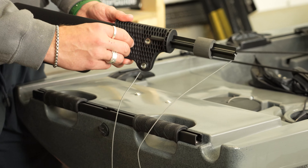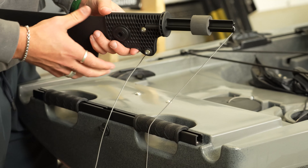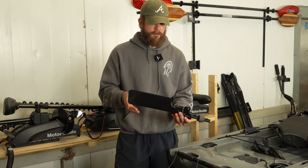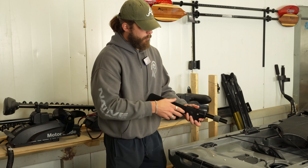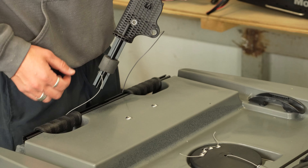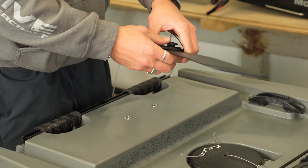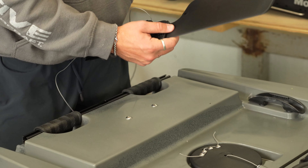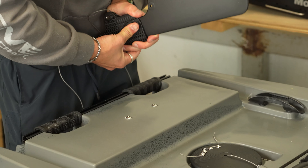Before I seat the teeth, I'm going to wind up my spring turning clockwise, and then press all the way down. Now I've got tension on that blade. Depending on how forcefully you want that blade to deploy, that will determine how many turns you take on that wheel. To uninstall, it's got a locking mechanism on the back side — just make sure you press in both sides firmly and then press through, and then you can either tighten or loosen up that spring. Let me demonstrate: locking mechanism on the back side, pinch both sides firmly and press through. And one more time showing how to create tension — just turning clockwise, and then press through.